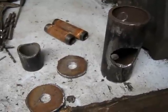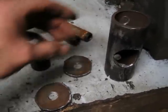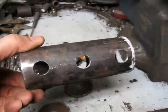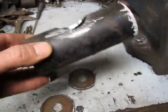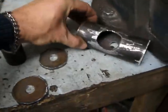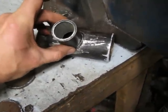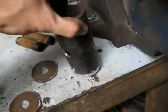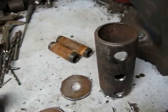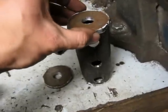Just working on the intake manifold for the five-cylinder Briggs radial — the Frankum Briggs radial. It's not a true radial. I've got three pipes coming out of the front there, carburetor feeds in the back. This pipe fits in there, so I'll get that all welded up. Still have to make the flange for the carburetor.